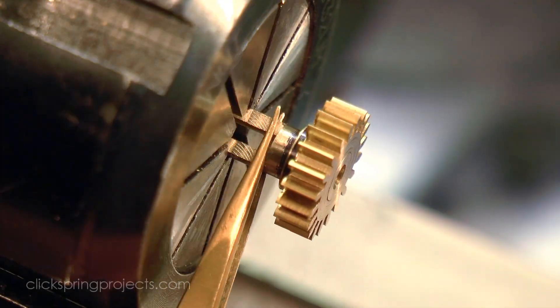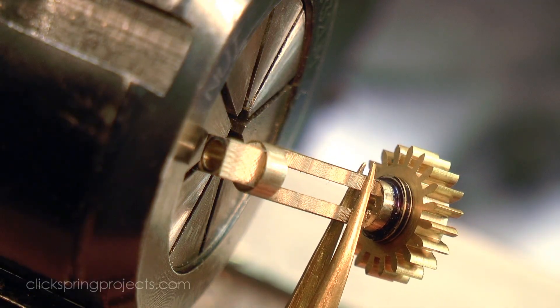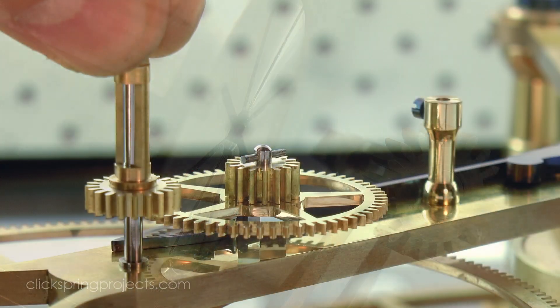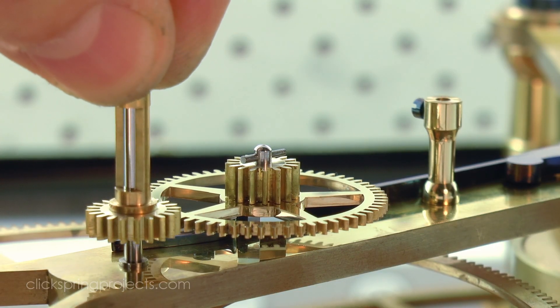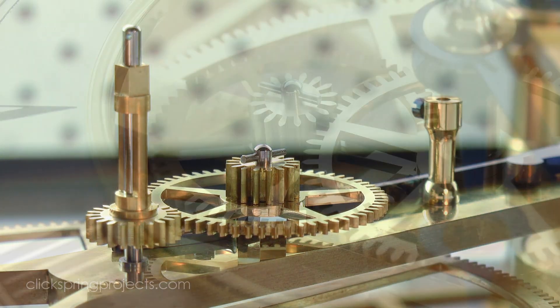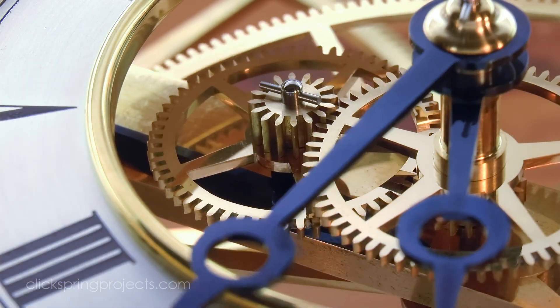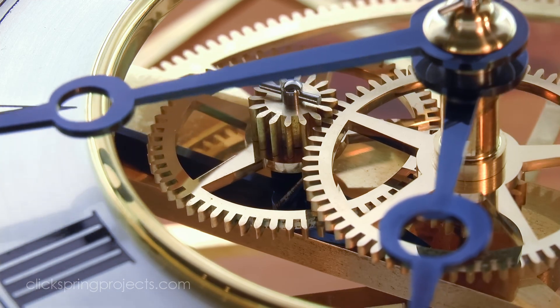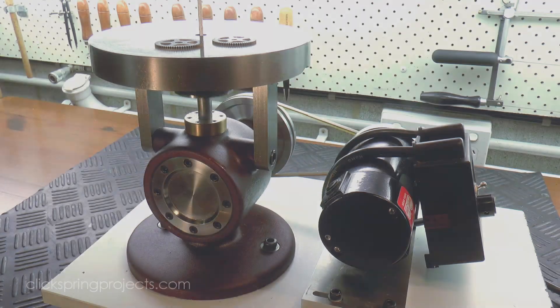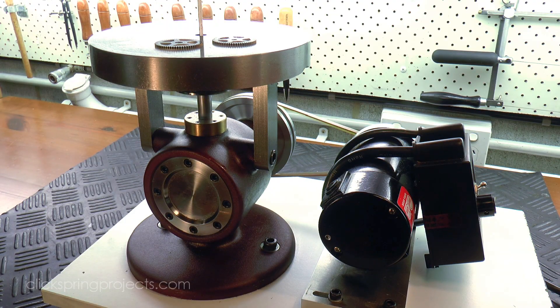With those two criteria alone, you've probably cut the field down to a manageable number, and you've likely identified the maximum size lathe you can both fit in your space and afford to buy. So the choice now comes down to what is it that you plan to make? How long and wide are the largest parts that you intend to work with? In what way will the lathe be required to hold them? And keep in mind all of the tool making projects that you're likely to want to tackle as well, because there's a fair chance that they might be the limiting factor in your lathe choice.